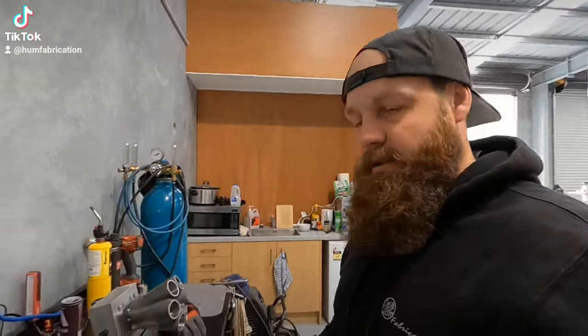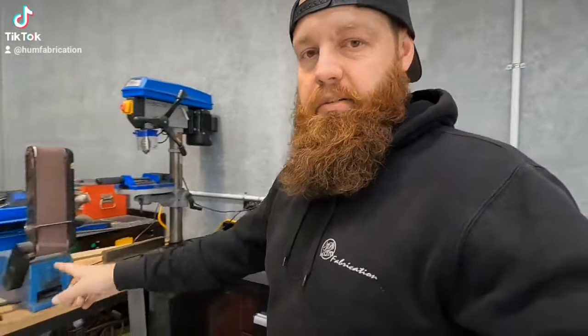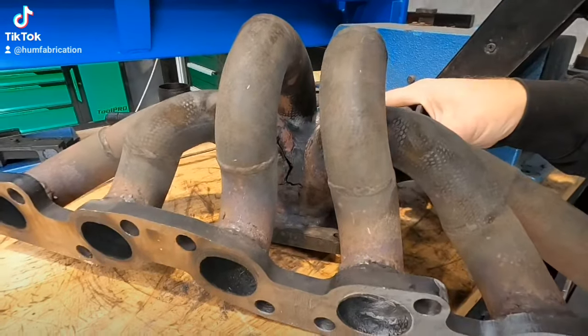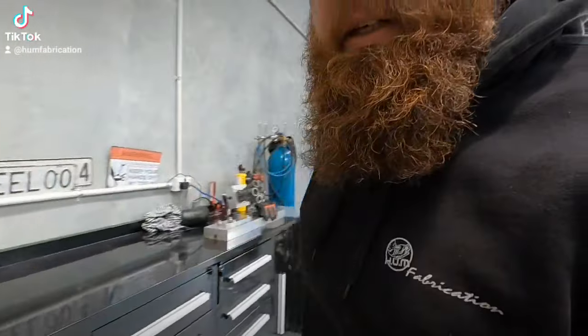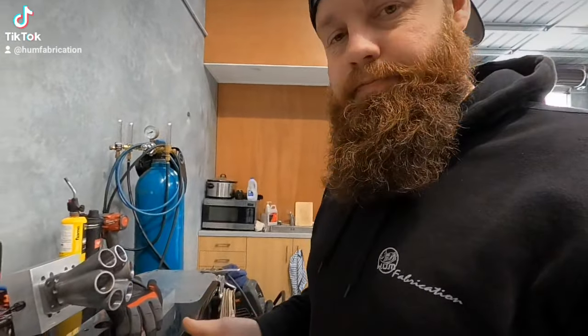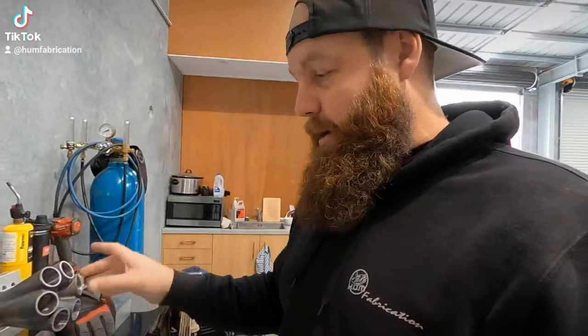What I thought I'd do was do a time-lapse of assembling and manufacturing an RB26 exhaust manifold. I've already made the jig — jigged off the original one, which is bloody full of holes. Just absolutely fucked. So we've already made the jig, which is very time consuming. Now we're into figuring out how we're gonna lay out our exhaust runners, because that's one of those older cheap Chinese jobbos. So we're gonna make a nice steam pipe one — buy the merge collector, buy the CNC flanges from Cinco, and then I'll make up my own runners.